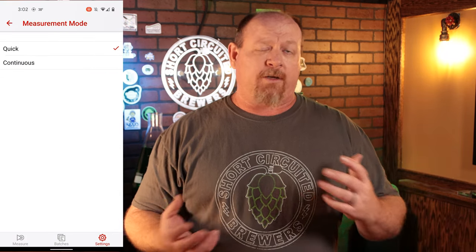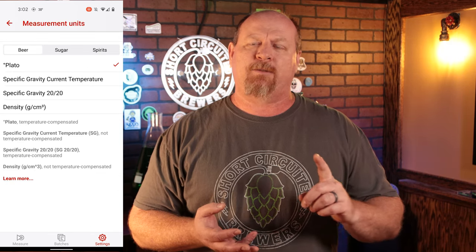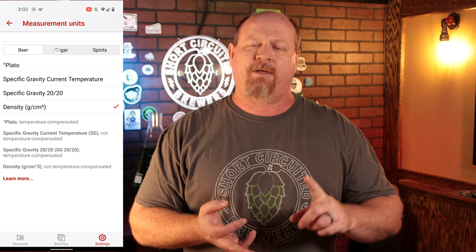It is not a one trick pony, so there are a couple other things I'll explain as we go along - it does more than just measure density of liquid. The accuracy of the unit is 0.001 on the specific gravity scale, so it's highly accurate. It has a couple of different modes where it will auto-calibrate for temperature and some where it does not. There are four different modes for measuring gravity: Plato, specific gravity, specific gravity non-temperature-adjusted, specific gravity temperature-adjusted, and also Brix.